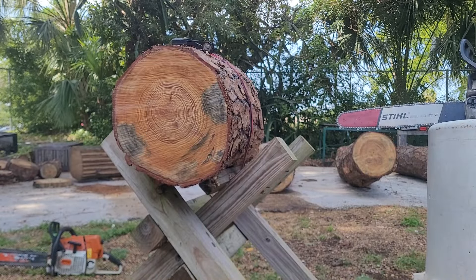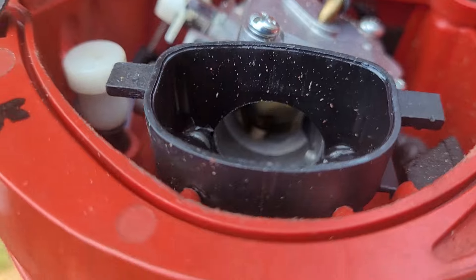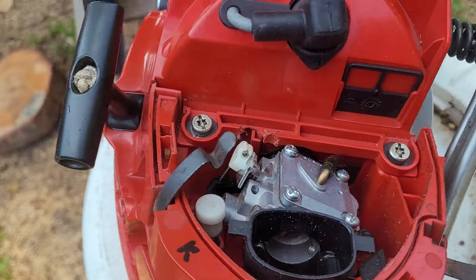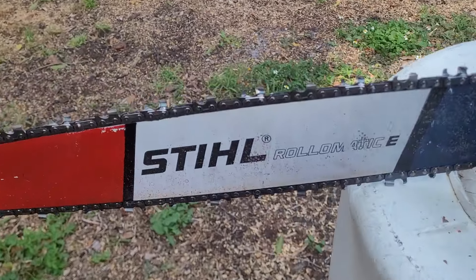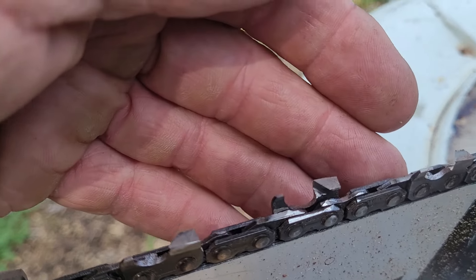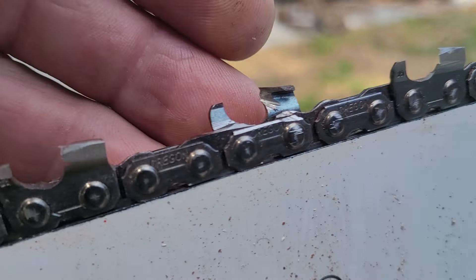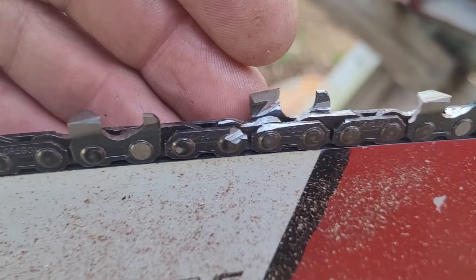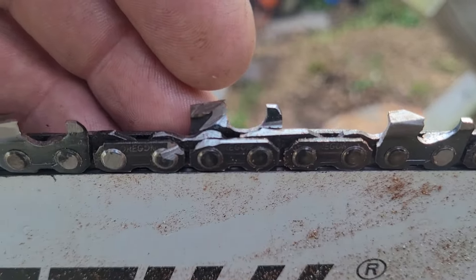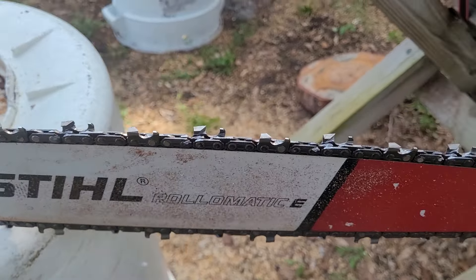Okay, let's go over what I did. This is the same chain I had on yesterday — this is the copycat killer. Look at that RWJ4 carburetor. Look at that big-ass Venturi. That's why I like these carburetors — they work excellent on these particular saws; some saws they don't work good on. This is that chain I laid the tooth back, made it more pointy. Plus I laid the top plate and the side plate back quite a bit more. I had to stone the shit out of it because these teeth are odd sizes. I didn't pay attention when I made this chain because it was sort of a work chain. The teeth were a little bit mix-matched as far as being different sizes, which is a big no-no in a performance chain because then you get a lot of lines in it.